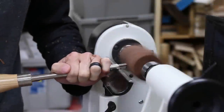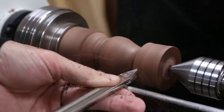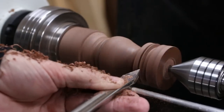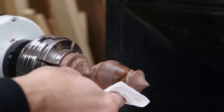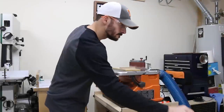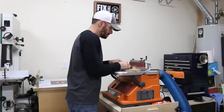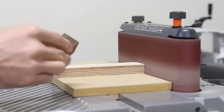Let's take a sneak peek of day 6's project. For the final day of my series I'll be getting a little festive and turning a Christmas ornament from some claro walnut. Make sure to check out the description or the end of the video for a link to the 6 days of beginner woodturning playlist. Back to the project — I put the jig in the miter slot of the sander and used the stop to hold the pen blank square while sanding it flush. You want to go all the way until you see shiny brass on both sides.